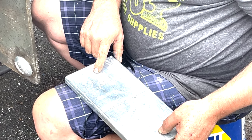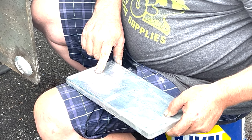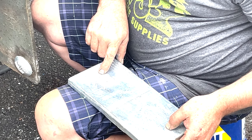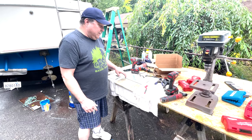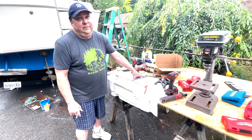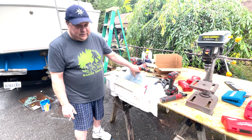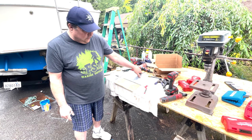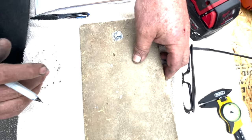Not really good ones because it wouldn't go flat because of the angle of the rudder until it goes on. And I can move those down to center it if I want. But that's where my hole should line up, those little paint marks right there. I'm going to use my old-fashioned figure-it-out method. I brought it down to the center line there that's handily provided on my zinc. So, check my work. It's lined up pretty good.